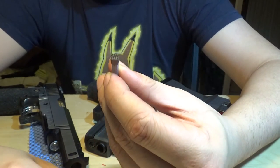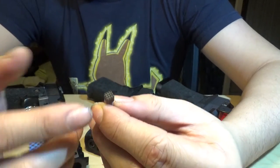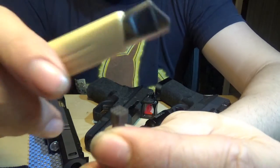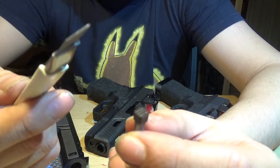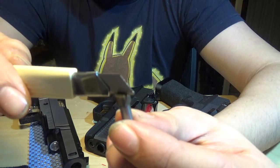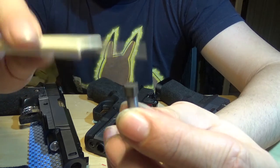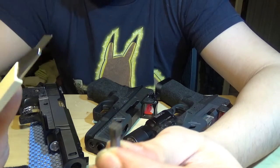The second problem is that whenever you decide to clean the tool, it's very difficult to clean. If you heat it up or use solvent, you have to dig the plastic out of this, normally by using a hobby knife or a cutter, and do this to just dig the plastic out like so, and then go like this and spin the tool, do another side, and so on and so forth.